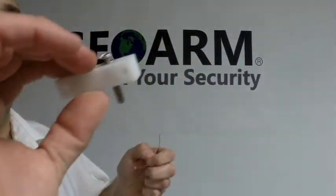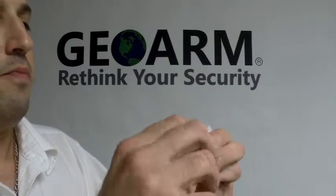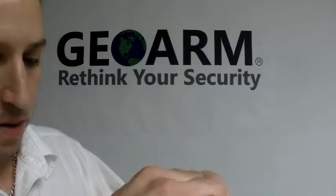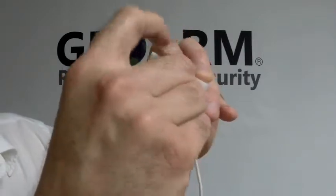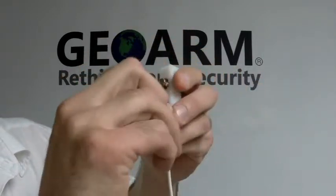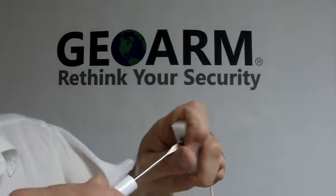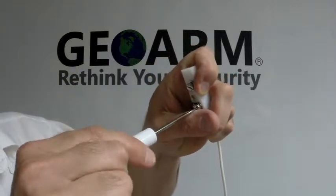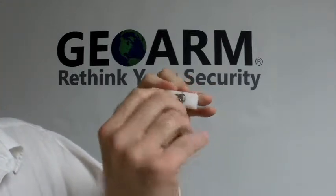There's also going to be a resistor that has to be placed in parallel along with these two screw terminals. All you're going to do on the screw terminal is put one wire and then the other. Your resistor, which comes in the package, is going to go in parallel — meaning it's going to go between both terminals. Put one end here and the other end here, then tighten it down. It doesn't have to be over-tightened, just snug. If you tighten it too much, you will break the wires and/or the resistor, so you don't need to crank it.